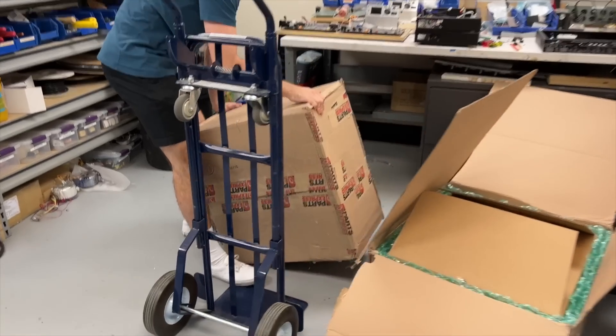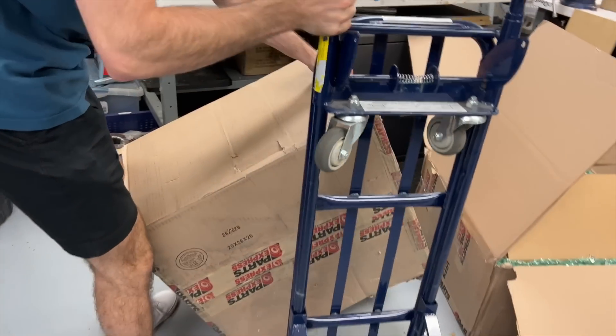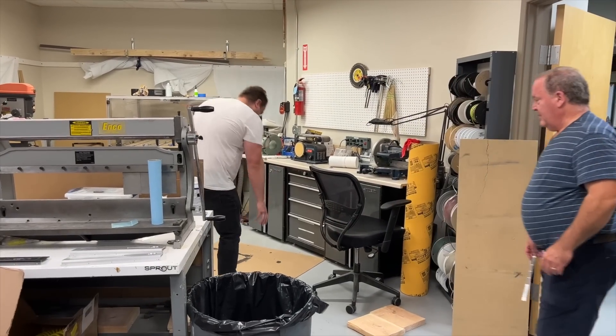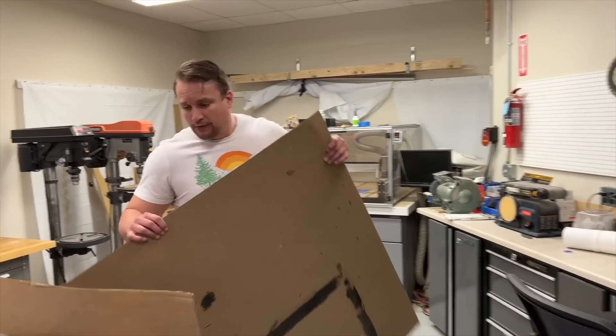So that's the woofer itself. Tell me about this woofer, Chris. Well, it's from the folks at B&C in Italy — they're one of the best pro audio manufacturers. They have a series of woofers with very high excursion, wide bandwidth, and high power handling. For high-impact subwoofers, they're among the best. This is a 21-inch pro model with about an inch and a half peak-to-peak of throw — not a short excursion, high-sensitivity pro thing, definitely in subwoofer world.